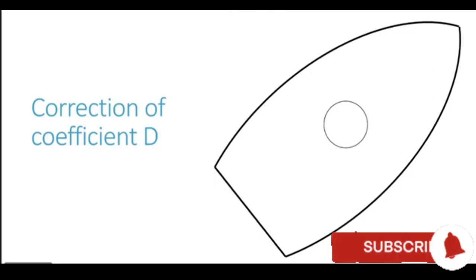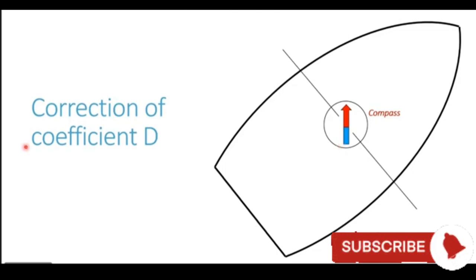Let's now show the magnetic compass on our ship. You can see the compass coming up. The compass needle is visible on the screen now, the north end of the compass needle having red polarity and the south end of the compass needle having the blue polarity. Let's now show the athwartship beam. Now this is the soft iron structure, an athwartship beam, which is responsible for generating coefficient D.